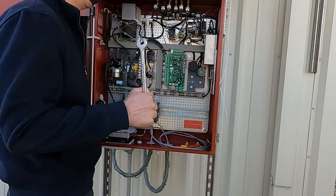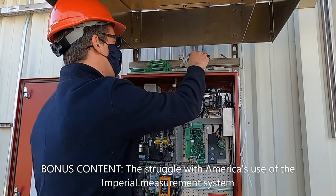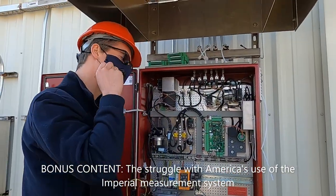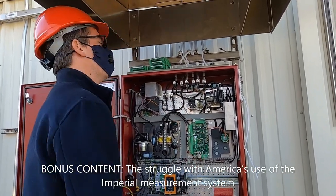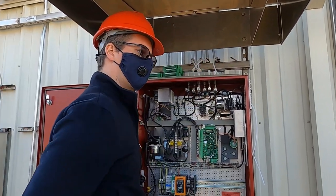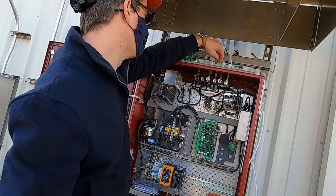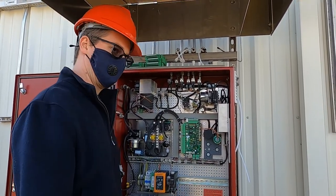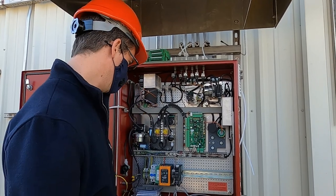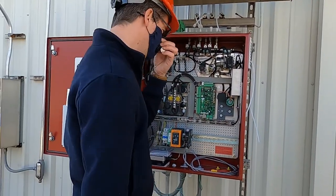Since we are a German company, this is a big issue here in the United States. A lot of people want to use different fittings — they try to find something but it's very hard. They call us and we tell them it's an M10 thread — metric. You have to find an M10 thread Swagelok fitting. Sometimes people want to use stainless steel tubes, but then you need different fittings. This here is plastic, but we have the same in Swagelok and stainless steel — you just need the M10 thread. The same applies to any European unit coming from outside America — everything is metric.